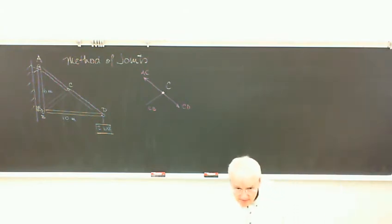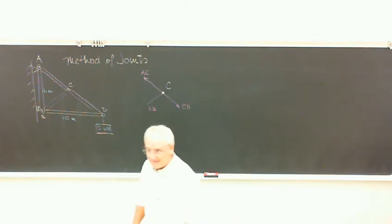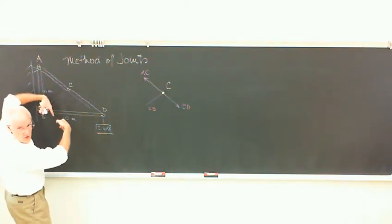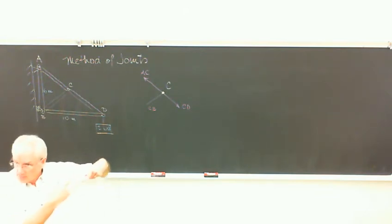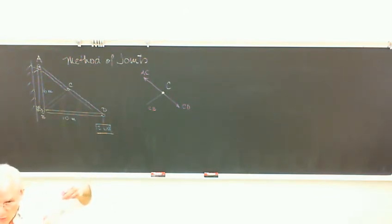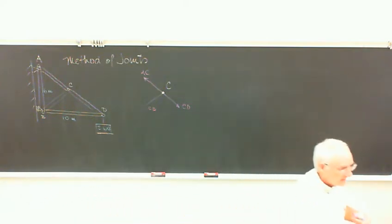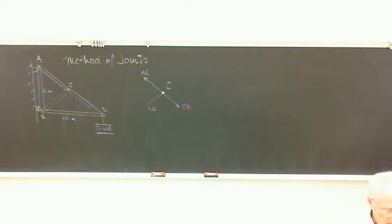Now remember, for the simple trusses, since they're two-force members, we're not taking into account the weight of any of the trusses. So you can't think that this joint would fall. It won't, not in simple truss world, because there's no weight pulling the members down themselves. So you can't think about what the structure itself would do, only how it responds to the load.